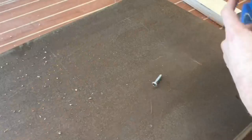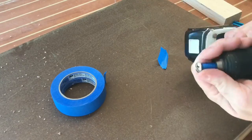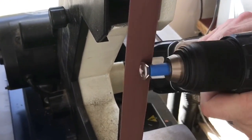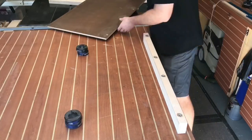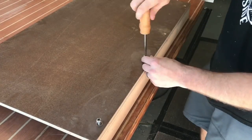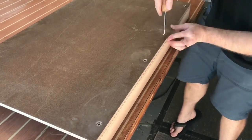My half-inch drill bit did not quite make a hole big enough to receive the half-inch tapered head of these screws, so I blue-taped some of the threads up, chucked them in a drill, and ran it over a belt sander — you can also run it over regular sandpaper. I took just enough material away to fit them down into those holes for a nice, flush, clean fit. Now it's time to marry the two pieces together. You probably guessed why I'm using threaded inserts and machine screws — I'll explain that a little bit later in the video. Everything lined up really well and I'm happy with it.